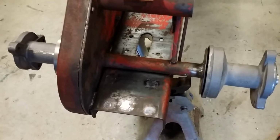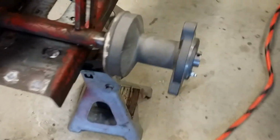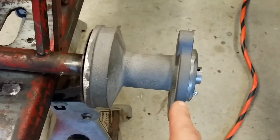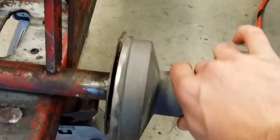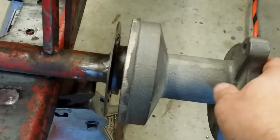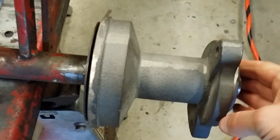Okay, so what are we looking at here? What I've done is I obviously have the axle still in place. I put the right hub, if you're sitting on the tractor, in place with the paw collar inside. Let's just pull that out real quick. There you go. There's the paw collar, and the Woodruff keys in place to hold the paw collar in place. So we'll just slide that on. Okay. And we notice we have the end of the axle shaft.